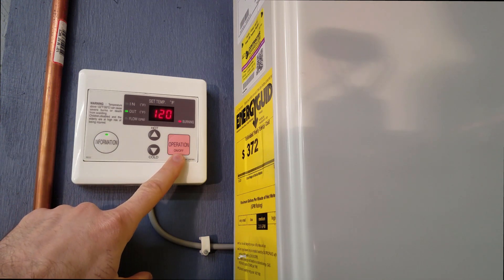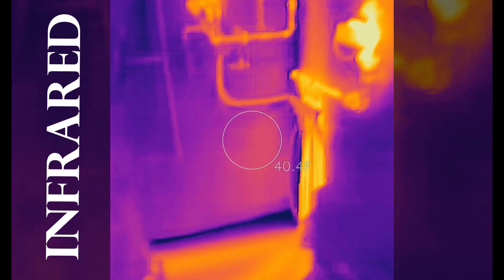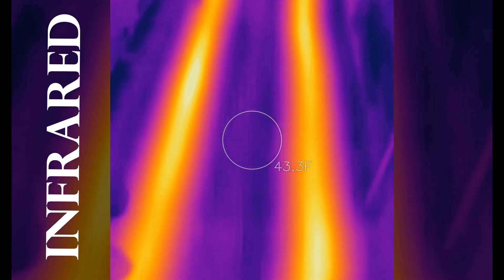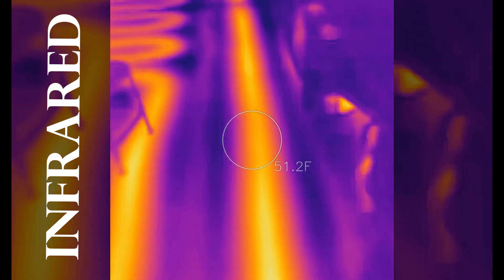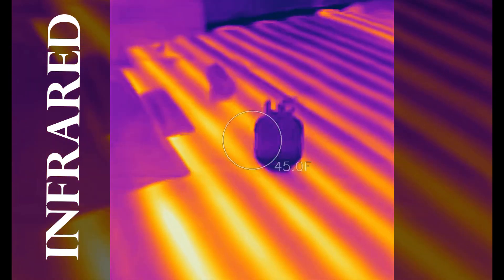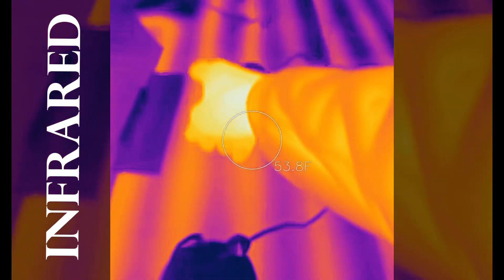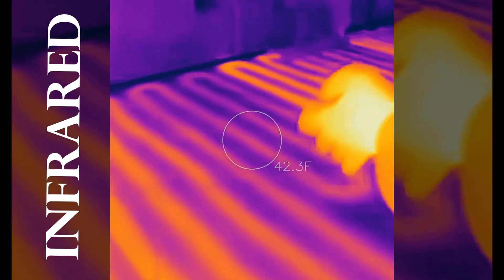This will just turn the unit on and off. My system has been running for about an hour. If we come over here and look at the floor with the infrared camera, you can see the heat lines going through the floor — that's 43 degrees in the middle, and over here it says about 50. What's really cool is you can see all of the heat loops in the floor. There's my hand — the loop starts over in this area, and as you go, there's the end of the heat loop, and then the next heat loop next to it. That is so cool.